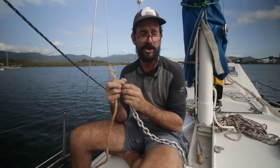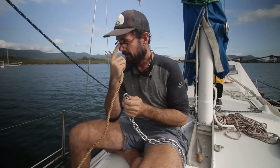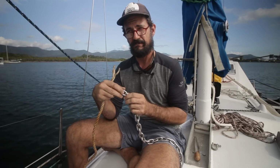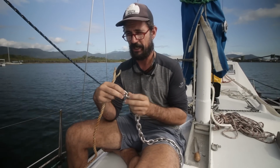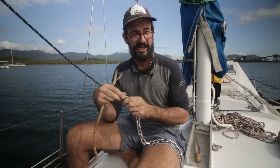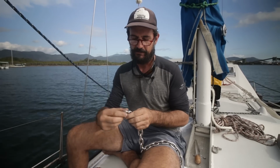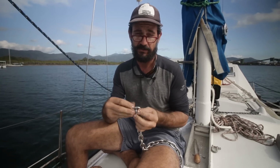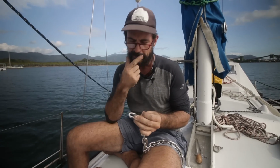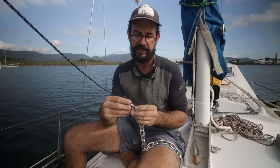Some people will say it's no good for anchoring. It can just fail without warning. I guess the principle behind that statement is that galvanized chain will show a bit of elongation before it fails. I can't remember the last time I saw some yachty going through and checking every link of his chain. But the other thing, in all seriousness, the real problem is where these welds are, they can get pit corrosion and you can get weakness and failing.